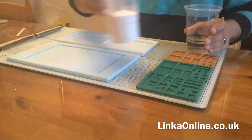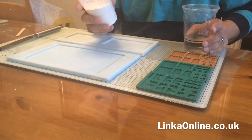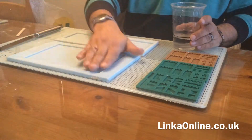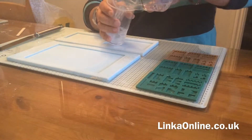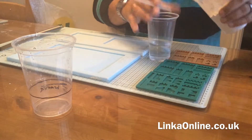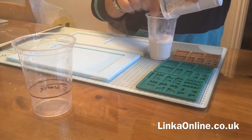As I did in video one, I'm casting with every 100 grams of my tough cast — which I sell on eBay and on the website — and 40 grams of water. Exactly the same combination using exactly the same stuff. We certainly need to use this type of powder because we don't want any expansion at all, otherwise we'll get a warping effect. Water into the cup, nice and straightforward. I'll mix this away from the mold so I don't get it all over it. Just start mixing it in.